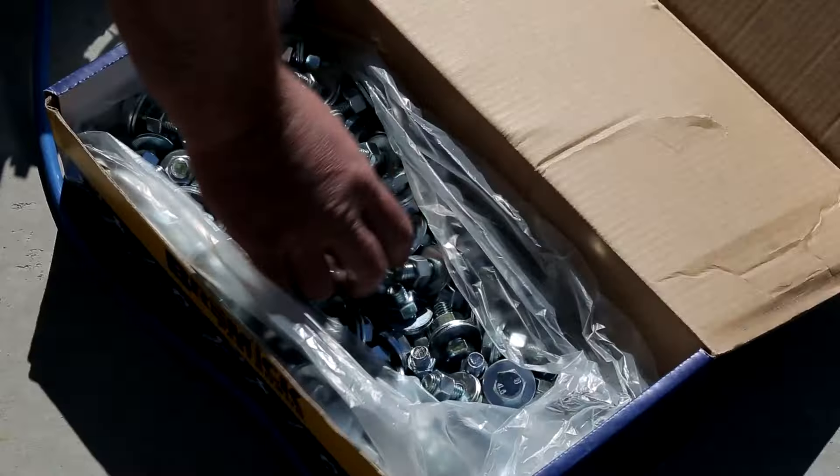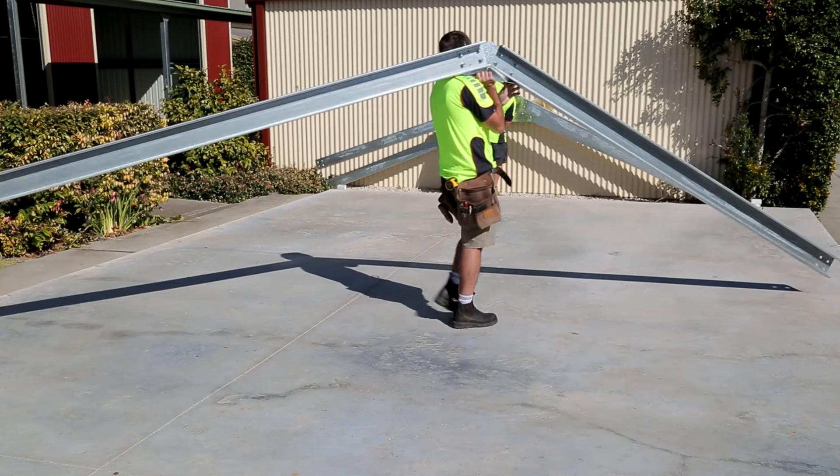Place a second tech screw through the apex bracket into the rafter, locking the rafters at the correct roof pitch. Then bolt the apex brackets securely into position as per engineering plans. Ensure all bolts are tightened. If apex braces are required, they can now be installed as per engineering plans. Repeat this process with the other rafters, then move them aside until required later.